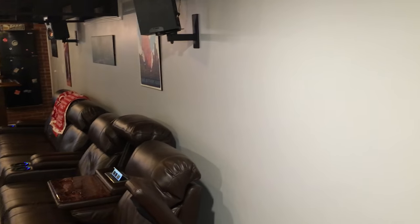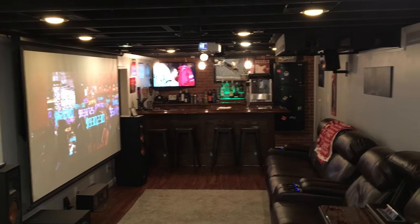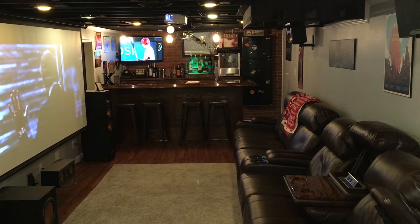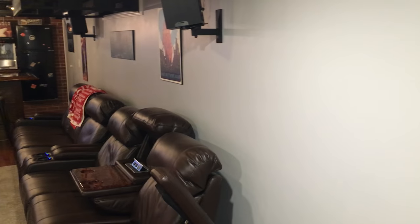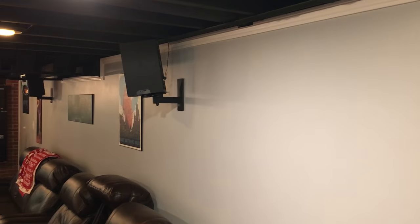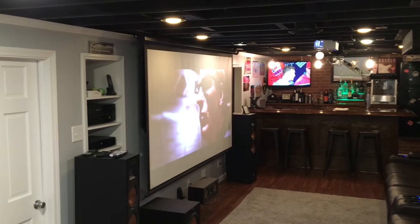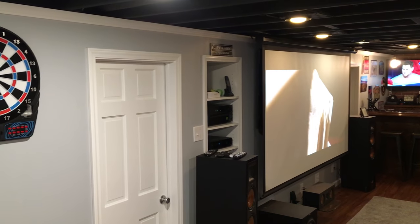For the walls, I removed all the wood paneling, ripped down the button board, and put new drywall up. I ran all new electrical on both sides — about three or four circuits down here so nothing gets overloaded. I insulated the exterior wall, then re-drywalled and painted. I also ran door molding along the top because it makes it look really clean, and it's much cheaper than crown molding — $0.59 a square foot versus $2 to $3.